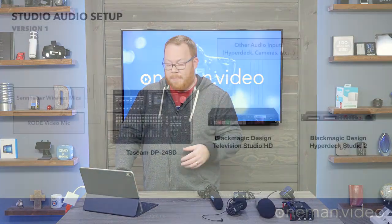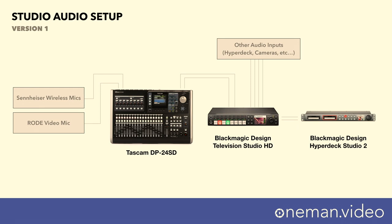I want to start off by giving you kind of the first iteration of what I did in the studio. So if we look here, you can see that first of all, I was bringing in some different microphones into a mixer. Now this was a Tascam DP-24SD. Now this is really a multi-track recorder — it is not a phenomenal analog mixer by itself. For me this was great because I was doing podcasting and I already had this mixer, but I knew I was going to have to end up fixing that; it wasn't going to be the ideal fit. I took the output of that into the ATEM along with all of the other inputs, like from my HyperDeck Mini that I'm using to run any other videos or lower thirds, and even camera audio you could pull in through there.